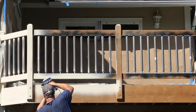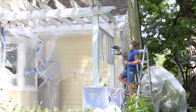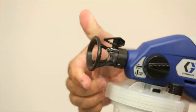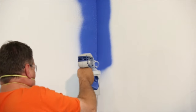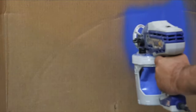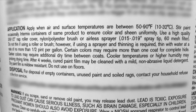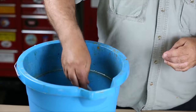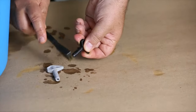For best results, the sprayer must be moving when the trigger is pulled and released. Aim the sprayer at the bottom edge of the previous pass, overlapping each spray pass by half. Rotating the spray guard changes the pattern to either vertical or horizontal orientations. When spraying vertical corners, turn the spray guard to the horizontal orientation and spray directly into the corner. A good spray pattern is evenly distributed as it hits the surface. If tails persist, the material may need to be thinned — follow the instructions on the back of your material container under spraying applications. Make sure to clean the tips when you are finished using them so paint doesn't dry inside.